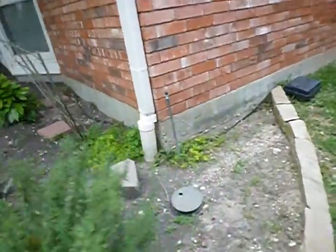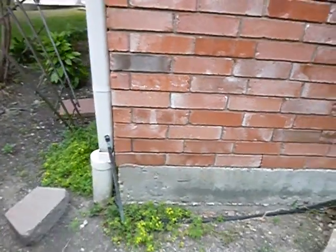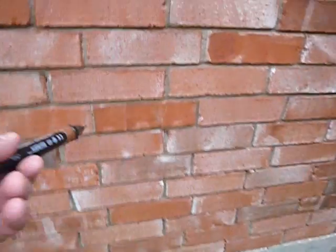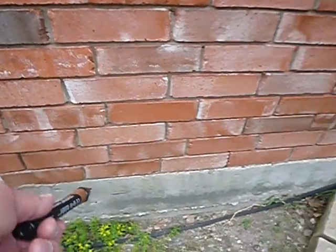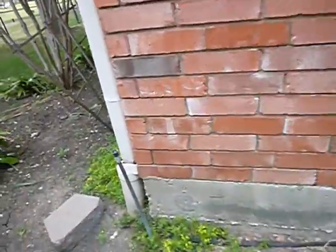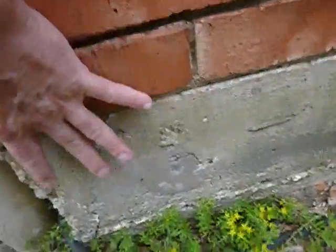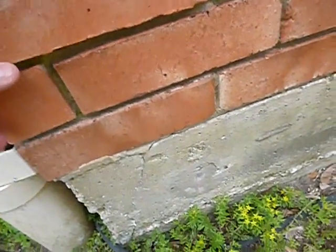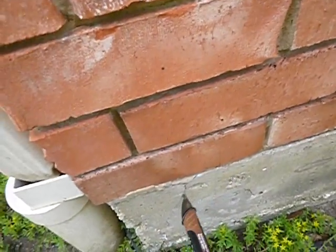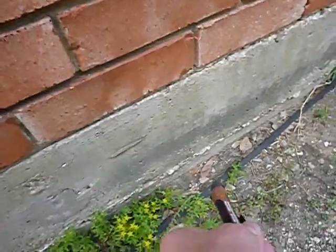You see this crack right here? It's called a shrinkage crack — some people call them corner pops. The brick and the cement have different thermodynamics; they heat and cool at different rates. The brick is the only part of your house that actually grows, while the cement is continuously shrinking. There's supposed to be a flashing between the brick and the cement, but that plastic never goes to the corners. If it's in the span of a hand and going vertically, that's not a foundation problem — that's just your typical shrinkage crack.